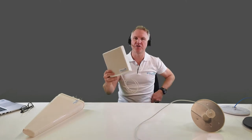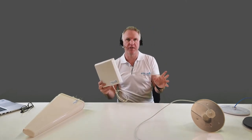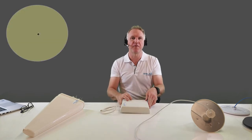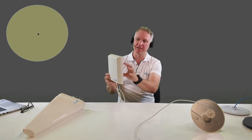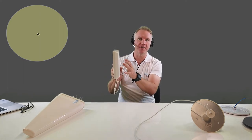Now the way antennas work is that every antenna is compared to what's called an isotropic antenna or an isotropic radiator, and that's a theoretical perfect sphere shape — a perfectly even radiation pattern around an antenna. This antenna doesn't exist in reality; all antennas are distorted from that perfect shape. By changing the elements within an antenna we can distort that perfect isotropic shape into a more desirable shape.